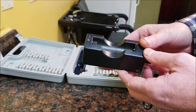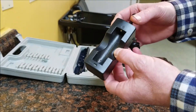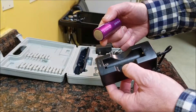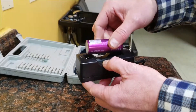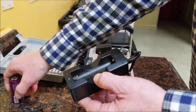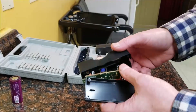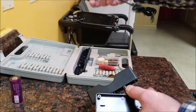I remembered I also had one of these single lithium-ion cell chargers. Now this one is built to charge 18650s - there's no reason I can't charge this 26650 other than it won't really fit in here. So what we're gonna do is just tie into the guts of this thing on the positive and negative, and cut the end off of this cord.